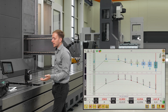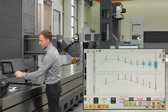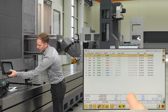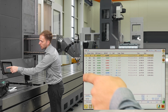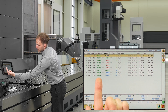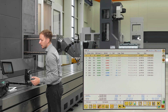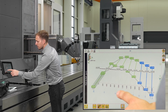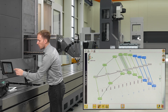After saving, we have a look at the results in the software. We see two charts, and in the table view we can see directly for the side values the maximum value, the minimum value, and the range — for example here, 34 microns. We see the measured positions and the measured values for side, height, and roll. With the roll data there is also a three-dimensional view, which gives a better understanding of the machine bed and can help extremely when aligning one.